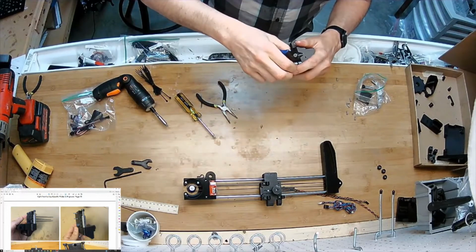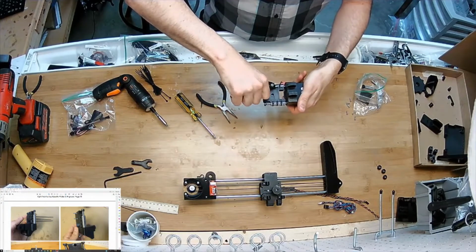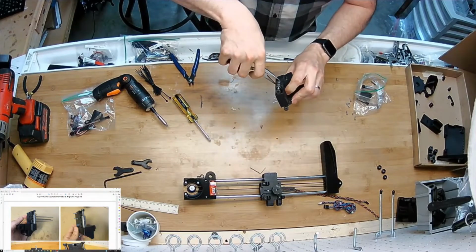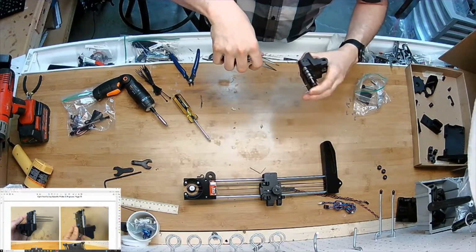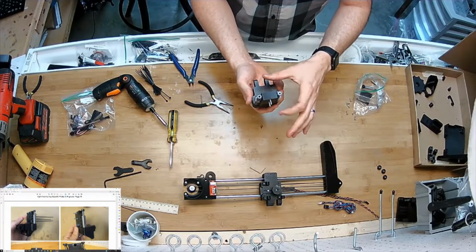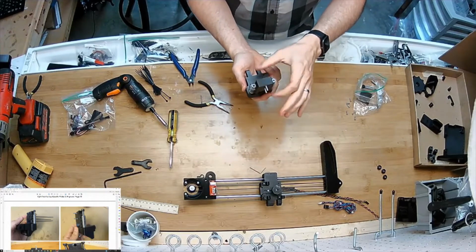That's it. Clip them off flush. And then I'll take my pliers and rotate those bearings now that everything's tight. 45, so it's kind of facing that way, and 45. There we go. As long as it doesn't stay up whenever I let go, we're golden. And since those are ball bearings, you can put a little bit of machine oil, not grease, but free-flowing oil in there. It'll do it good.